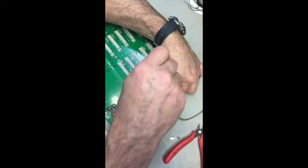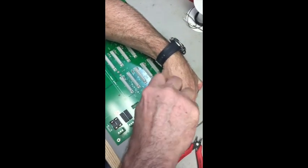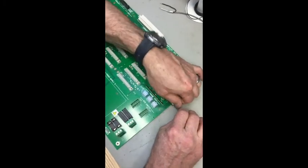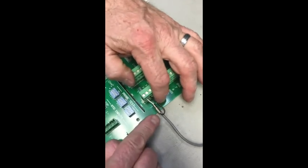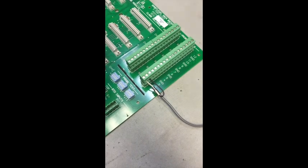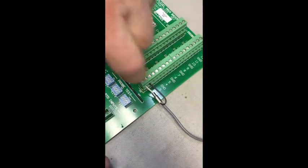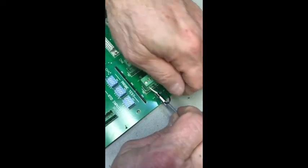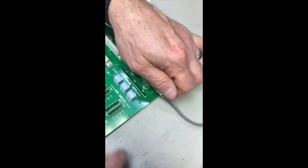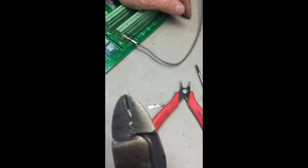To prepare the other side of the wire at the terminal blocks, prepare the ferrule the same way, except it is suggested to use about a six-inch piece of ground wire. That way, when connecting the grounds in the junction box, it allows more room to dress and twist the cables together for a common ground connection. The signal conductor will be terminated using this type of crimping tool with a fork spade connector.